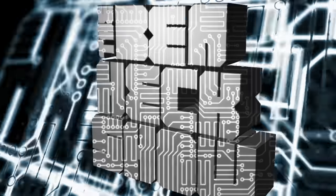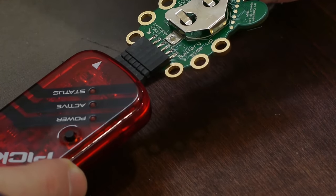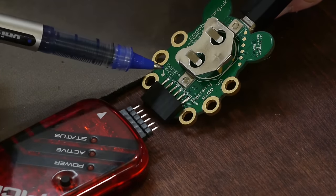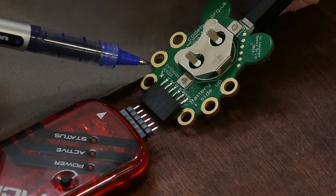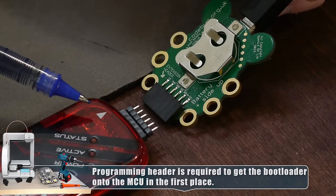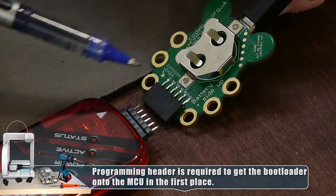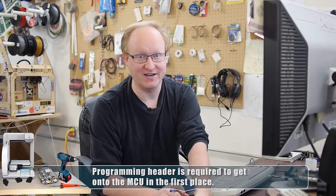Let's talk about a few more programming examples. I noticed something here with this header at the bottom — it looks like a PIC programming header, but it isn't. The pinout has a few of the same things, but ground is in a different place. Then I noticed these six pins intended for a Pogo spring-loaded programmer — those are what were used to program the microcontroller. There's a little white arrow pointing at one of them. So this is not the programming header; those pogo pins are. So I'm not going to try to do a ROM dump of this.